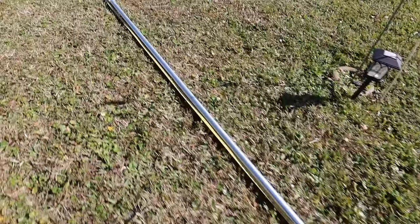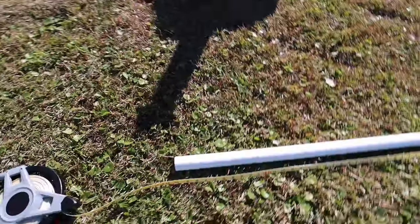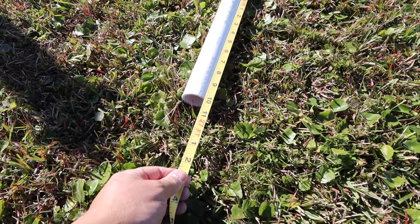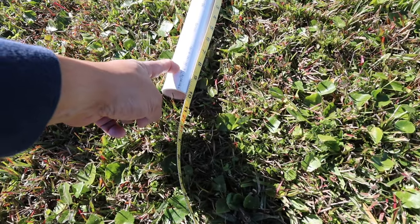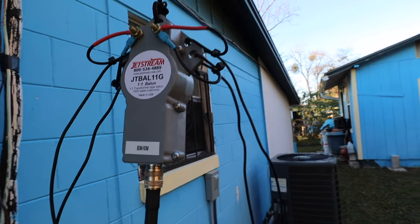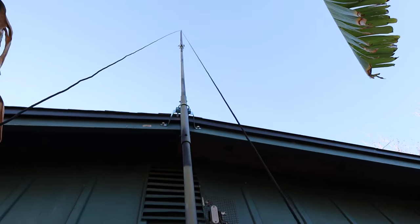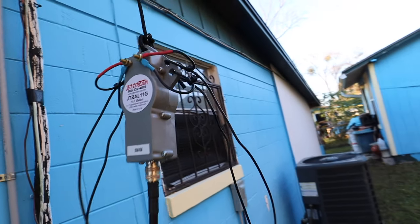I got the measuring tape attached and I'm just going to show you the actual height. Right here it's 26 feet 10 inches — just short of 27 feet — but I need to drill a hole here straight through so I can attach my eyelet. I got my fan dipole connected to the 1:1 balun. I got the mast, the 27-foot section, wedged up against the house on the U-bolts all the way to the top, and I'm getting ready to hoist the 1:1 balun to the top.